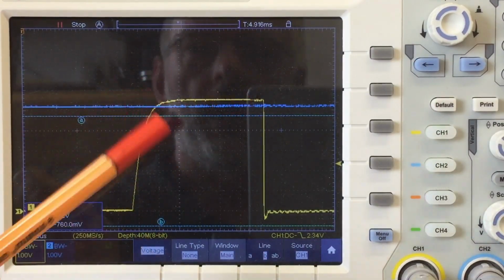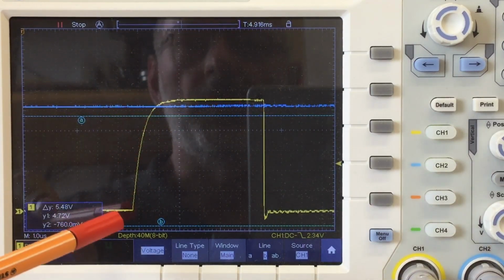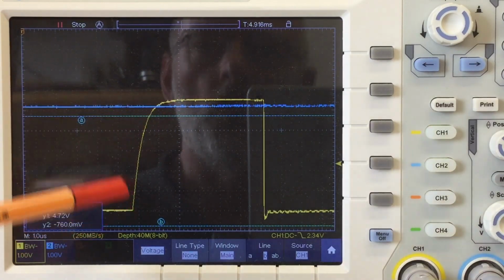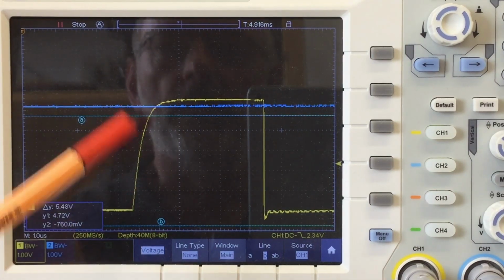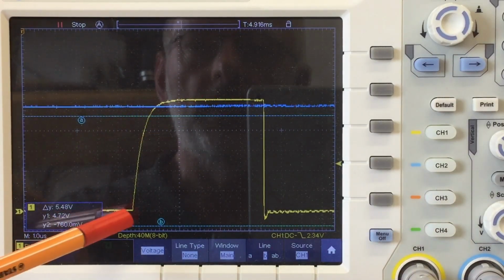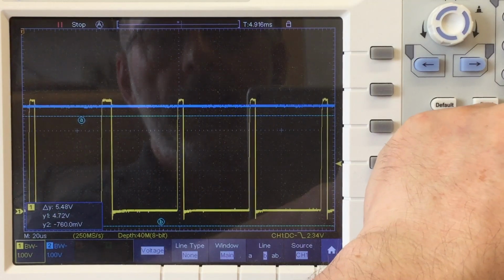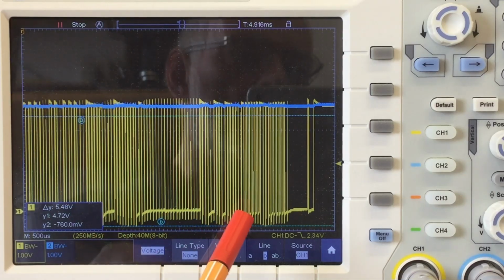And they are, but they don't really have to be that nice on an I2C bus. The rising edges on an I2C bus, with pull-up resistors and open collector pull-downs, are always a little bit slow. So maybe when we increase the value of the pull-up resistors again, just a little, not to 4.7K again, because that didn't work, obviously, we can limit the undershoots a little bit more.